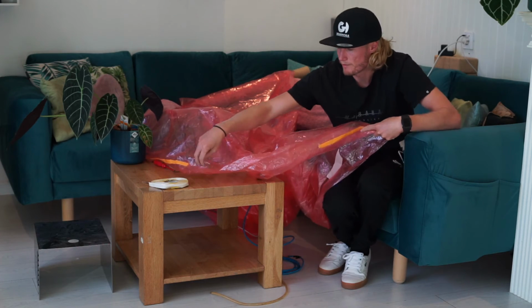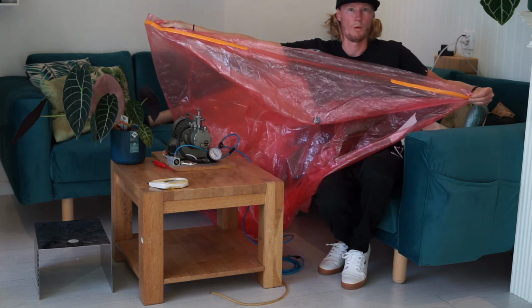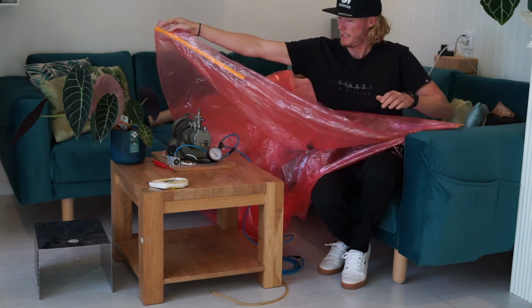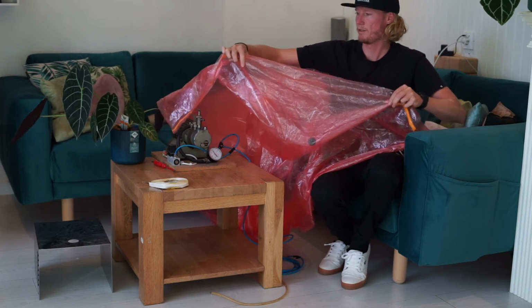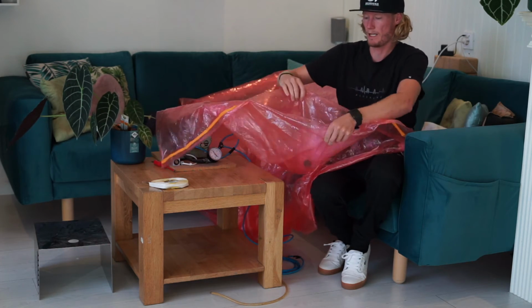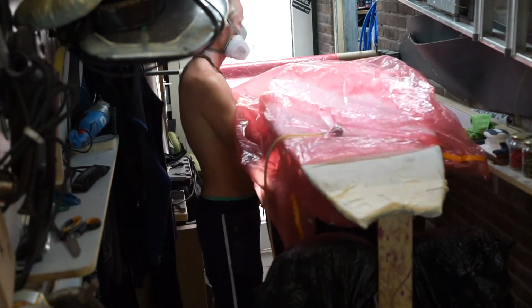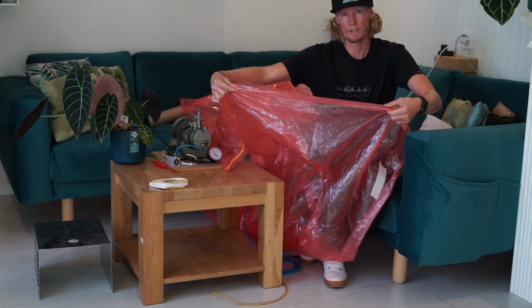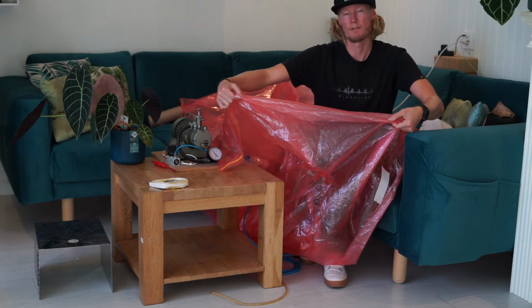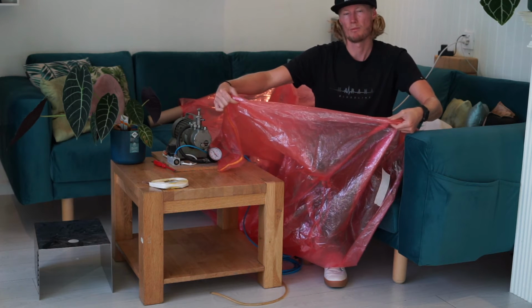And this is the front of the bag. You can see it's a pretty wide tube. I've left an opening in the middle with no tape, so I can put my blanks with carbon or other stuff in here. And then I'll seal this middle part with some kind of chewing gum, but then specially made for vacuum bags, so I can keep reusing this bag.